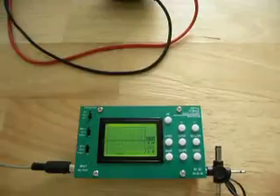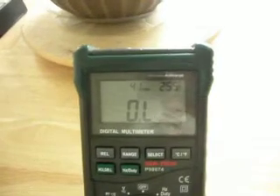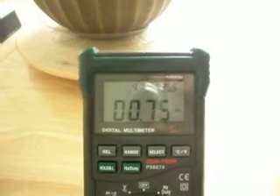The first thing we're going to do is measure the resistance of my body using this meter. I'm going to pick up the probe and you can see that the meter is not actually reading anything — it's on overload right now, so we're out of range. The reason for that is because I'm standing on my shoes. So I'm going to step off my shoes and onto the tiled floor. And we can see that we have a reading of almost 1 megaohm, just a little bit short, which is pretty typical of what happens when you walk on a tiled floor.